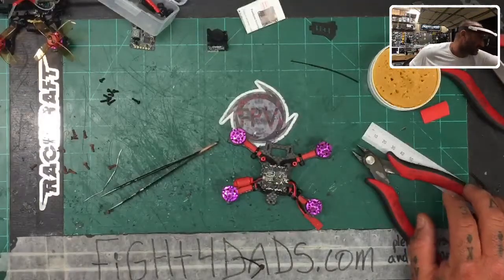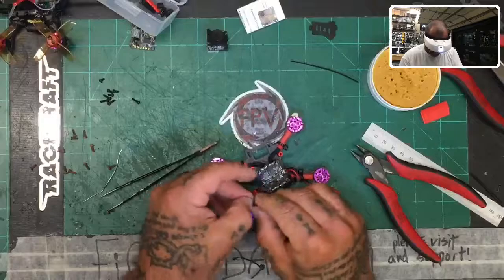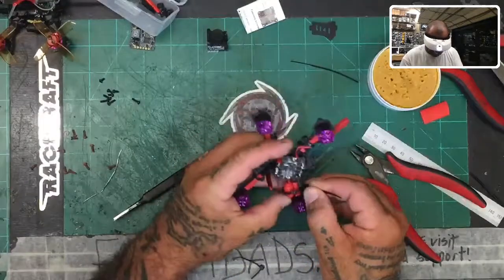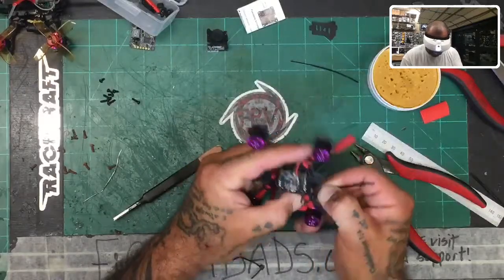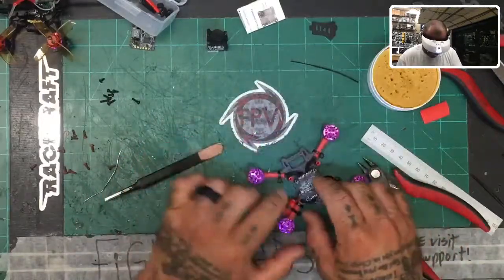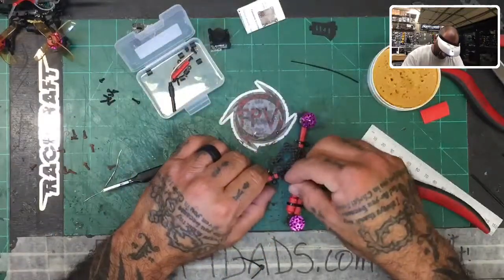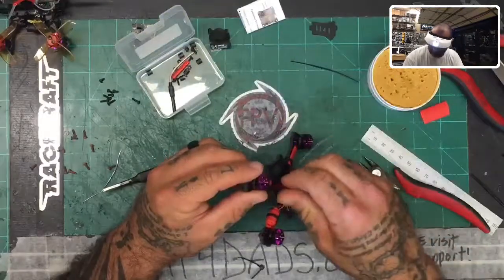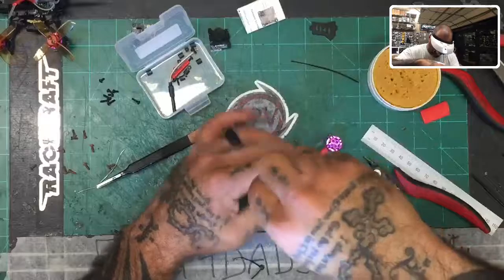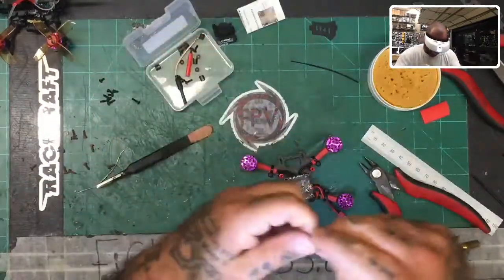Crisis diverted — if any of you noticed the error during the video, congrats, because these are the kinds of things you want to watch out for. Even if you think you know it all, you still make mistakes. So that's done and corrected. Now we're going to go ahead and add another zip tie on there. From here, we want to go ahead and get ready to put in our flight controller, so we're taking the next set of 5mm standoffs and screwing those down.